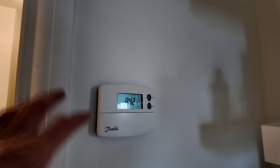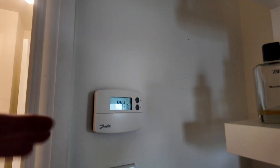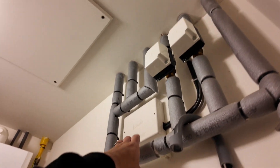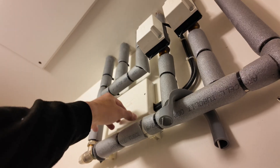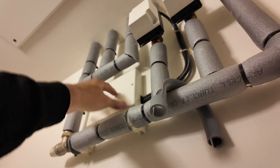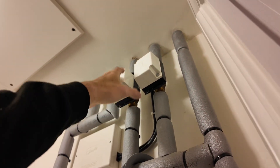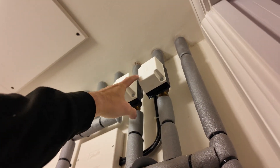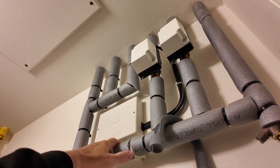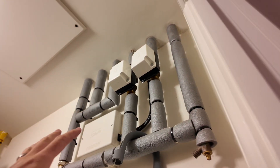I might cut a pattress box in and fix the thermostat to that, as I've done that in the past and it makes it a lot easier. Looking at the boiler setup - we've got the boiler, we've got the wiring center up here. It's already wired from this center so there's no need to take the cables apart. We've got the two valves controlling the two zones, so we've just got the wired thermostats to control all the areas.